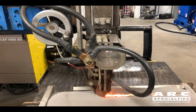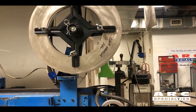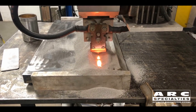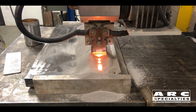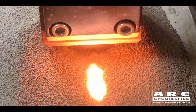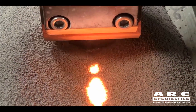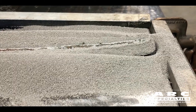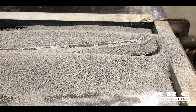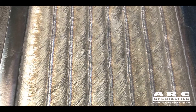Here we see the strip head and feed motor pulling the strip off the coil. The welding action should be smooth with an occasional pop. You will notice that the strip pushes the flux out of the way in front, with some of it flowing around the sides. The center of the weld should have molten slag exposed on the surface, and the slag should be self-peeling as it cools. The surface should be smooth and free of porosity.